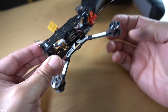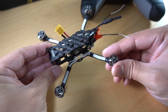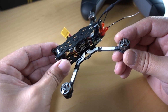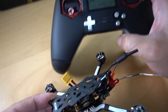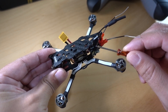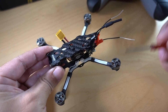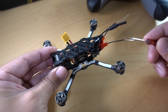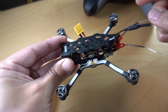It's got most of your basic parts: motors, ESCs, flight controller, video transmitter, and cameras. This procedure will be applicable to pretty much any size of drone in terms of setting it up, making sure it's working with Betaflight and also working with your radio. The first thing I do is bind the receiver to my radio before I hook it up to Betaflight — make sure that I have a bind — and then I can go through all the Betaflight setup things I need to do.